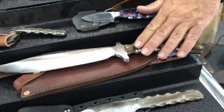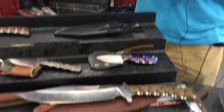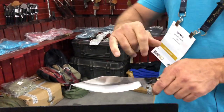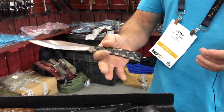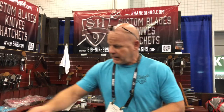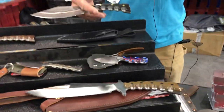I started with a full Bowie, but like the big stuff, people like to handle it but it's not viable for most people. So I scaled my Bowie down to what I call a compact Bowie with a six and an eighth inch blade. I removed the spine-side guard so that you can actually use it, and I increased the belly just a little bit — so it's a general outdoor utility knife. You can baton it; my false edge comes out short enough so it's still batonable. The handle is burlap micarta — burlap G10 — from Current Composites out of Massachusetts. They do this burlap in black, natural, and red. It's a phenolic resin processed the same way as G10 — burlap as the fiber, dyed, phenolic resin added, then autoclaved under heat and pressure. Same durability and density as G10. I just liked the way it patterns.